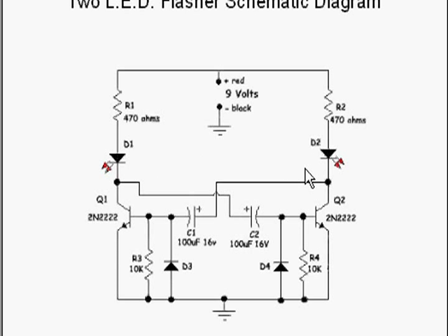This circuit uses four diodes. Two are LEDs — you can have any color you want; mine were red. Then there are two regular silicon diodes, plain garden-variety ones you can pick up anywhere. Make sure they're inexpensive because they really should be very cheap. These were add-ins I put on later after building the original to improve operation — they discharge the capacitor rapidly. They aren't on the original, but we'll talk about that as we go.